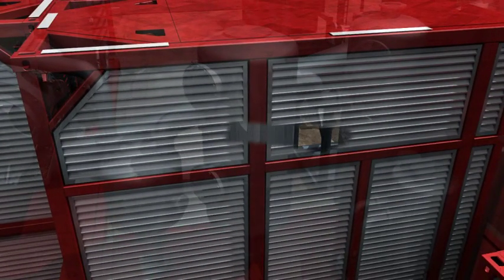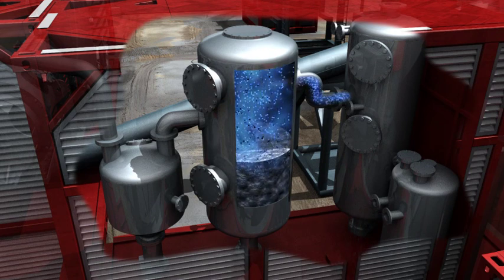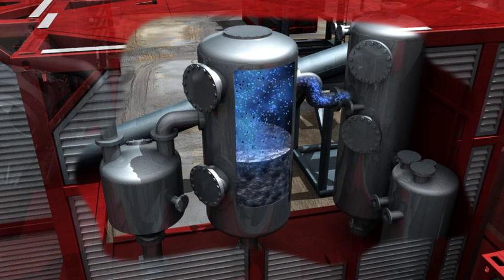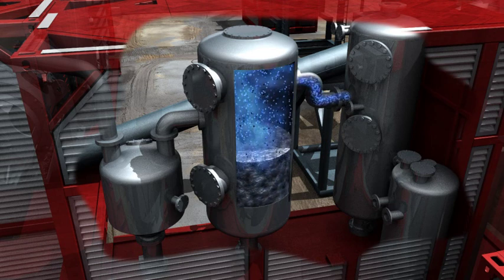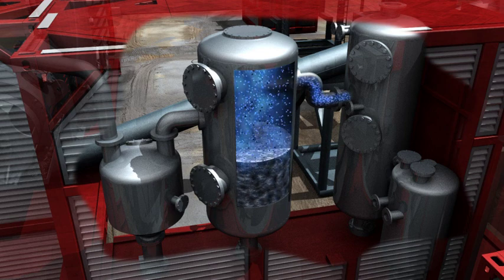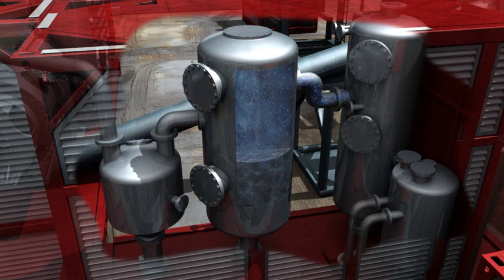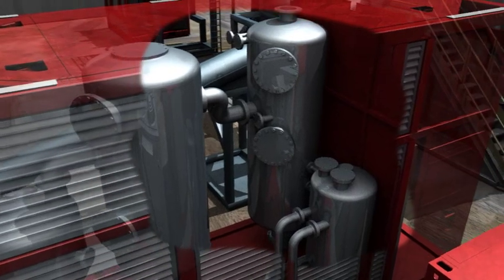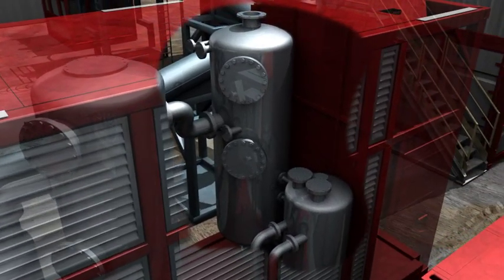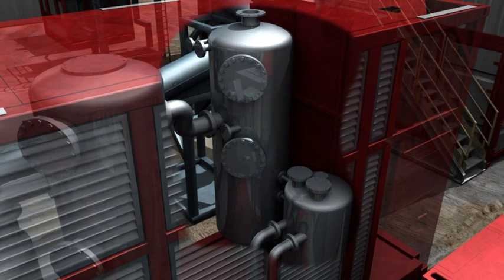The remaining oil vapor is condensed in the oil condenser. As the oil flows downward, it cools the flowing vapor, which leads to condensation of oil. The cooling is controlled to achieve a final vapor temperature of 221 to 230 degrees Fahrenheit or 105 to 110 degrees Celsius to avoid condensation of water. A level switch opens for discharge of oil. Water vapor then moves into the steam condenser, which uses the same method; the temperature is lowered so that all vapor condenses into water.